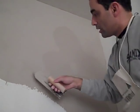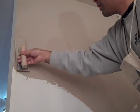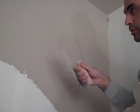You can get the basics, but to get it to where you want. See, again, I pulled it too much. I'm actually going over it too much in some places. But I go back, and it's done. There's a line here. You just go back. I can push it. Now, sometimes, because of the aggregate in the clay, like little pebbles or whatever, you'll see lines in it. That's just because it's pulling it. Okay. So now I got to this point. So are you looking for a smooth?